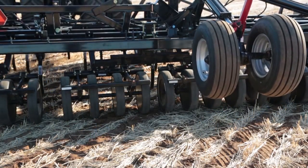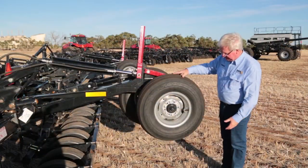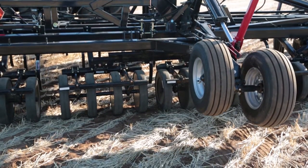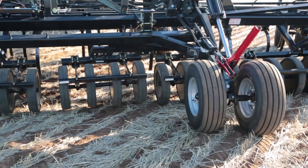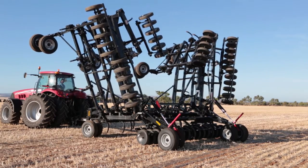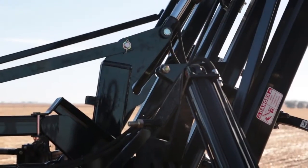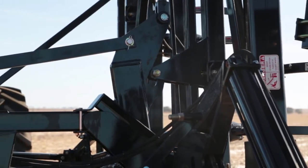Transport wheels on these come up well clear of the ground to clear your air cart hitch, and when lowered down to the ground they bring your press wheels clear of the ground for transport. When the machine is raised to transport width to fold up, the transport wheels at the rear push down onto the ground lifting the press wheels clear, and then the wings come up and fold over two hooks where they slip in and pull over centre. This makes it not necessary to use transport pins, and being over centre makes them sit in nice and secure so they won't jump out of their hooks — making it really safe for transport and saving the operator time by not having to get out and put pins in.